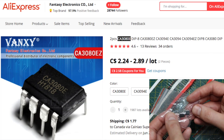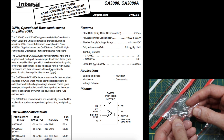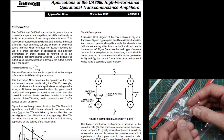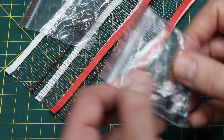These I believe would be some sort of op-amp — CA3080E. That one is an operational transconductance amplifier. I haven't worked with these before, but the output is represented in terms of generating current rather than voltage as the input changes. I thought I'd get a couple and look into it at some point — maybe there are some interesting projects I can come up with.